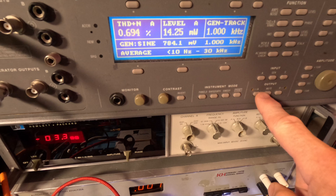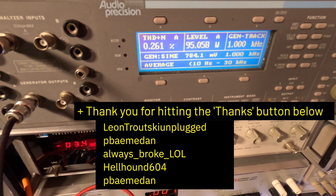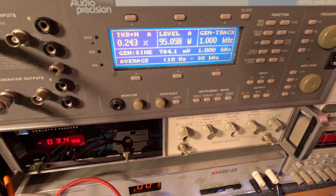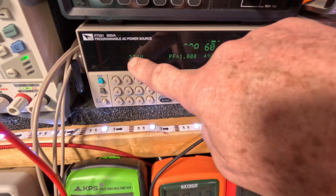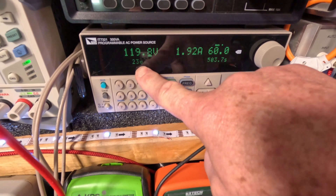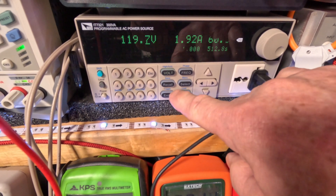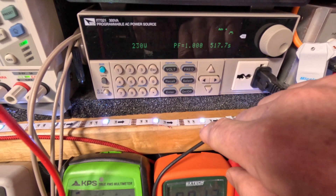We're set up for a thousand hertz. We go ahead and turn on the signal. We've got about 95 watts on one — now that's actually times two because it's calculating for eight ohms instead of four ohms, but that's where it's set right now. The voltage is about 119 at the output, 230 watts. Power factor — look at that — this is crazy. It's one. There's no leading or lagging. It's just one. That is crazy. VA 230 watts, 230. Isn't that crazy?